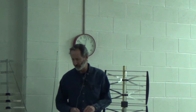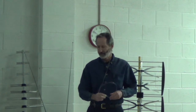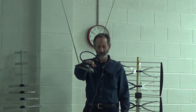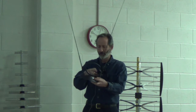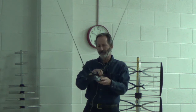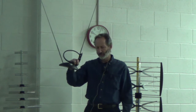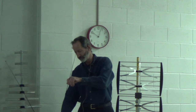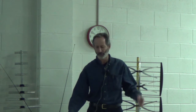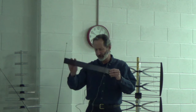A lot of you can remember when our televisions had a little loop on the back called a UHF antenna, and then there was the rabbit ear antenna with two telescoping elements. An antenna like this is not going to work as well as an outdoor antenna. When I go out to install an antenna for somebody, one of the first things I do is try an indoor antenna first, because a lot of times you might live in the perfect location where you'd get away with a set of rabbit ears or something like this little bar made by RCA — it's got a little amplifier built into it.